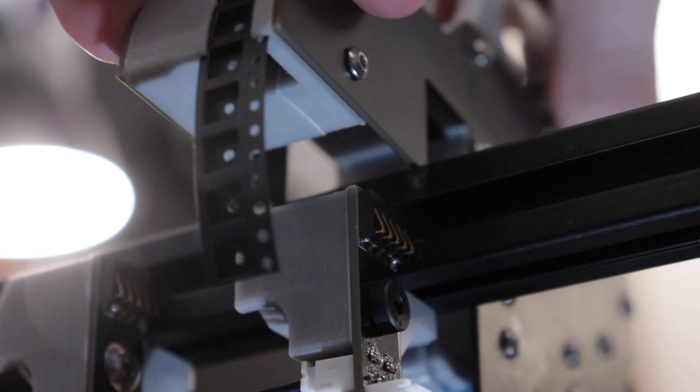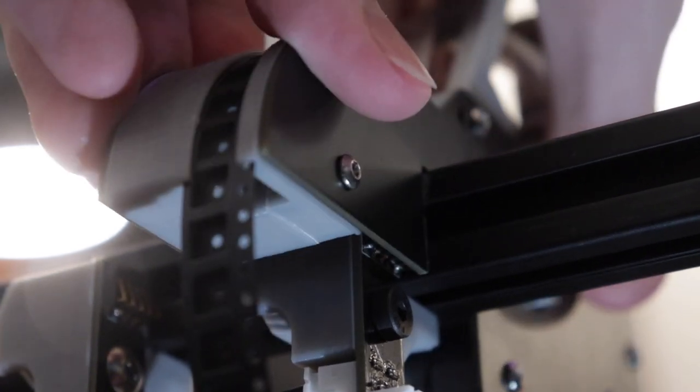Okay, so before we get into all the fancy addressing stuff, first we need to just get RS-485 working. I've added some hardware to the motherboard that will take in a UART port, so just a standard serial, ones and zeros spitting out data, and it will convert it into RS-485. RS-485 is just an electrical standard. There's no protocol of first you send this byte, and then I send this byte, none of that. It's just what is the electricity doing?